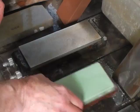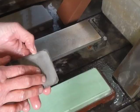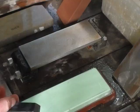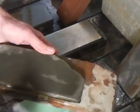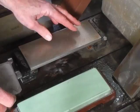Scott, I'm going to make this video for you regarding working on a Kanna blade. A lot of your Kanna blade work is going to be ura-dashi and ura-oshi. I've already done ura-oshi, and I did ura-dashi the other day. For ura-oshi I have a dedicated Japanese natural stone that I use, and I only use it for the back of the Kanna blade, the ura side. So this is pretty much ready to go.